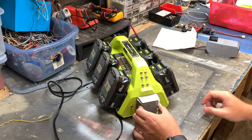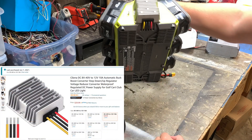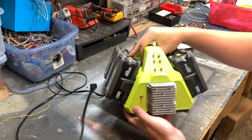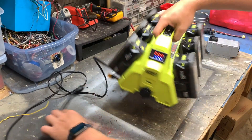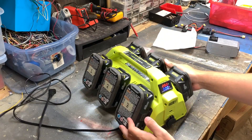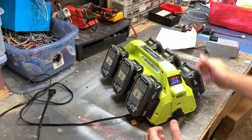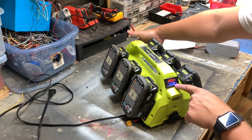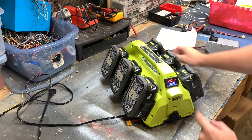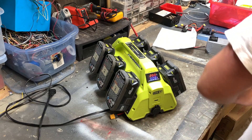My V2 was able to share the positive of that output, and now I have a DC-to-DC buck converter on the back — not very neatly mounted, I'll admit. This switch completes the circuit to make it live, because the blocking diodes also have a parasitic draw. So it is a buck converter — I flip the switch for that.